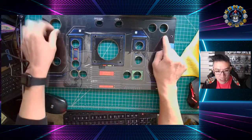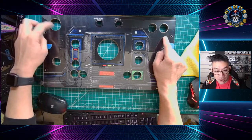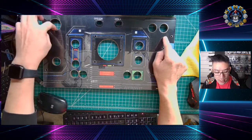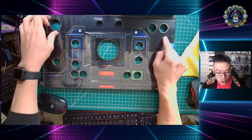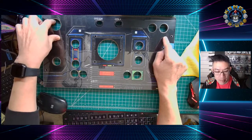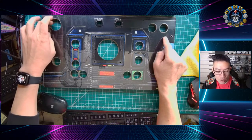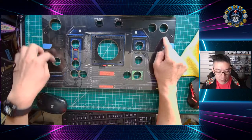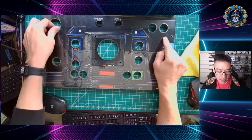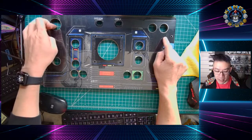And then this is the analog joystick controller that needs a different bit, so this is a bigger hole. I believe it's a 1 1/2 inch hole saw that I use to make this big enough so I can fit the entire joystick through. Depending on what you have, you'll want to make this bigger, because otherwise if you make a hole this small, you're going to have to take apart your joystick. So I recommend a bigger hole, a 1 1/2 inch hole saw if you can.